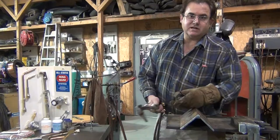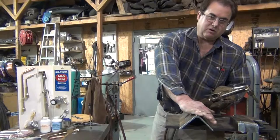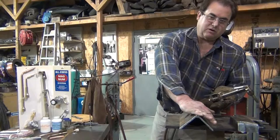You'll notice that we won't have to follow it down like a standard blue-flame setup. We're going to take advantage of this Magnum torch. I'm going to anchor myself and just point the torch at it. You'll notice how clean burning it is and how fast it is on the preheat. This is a cold piece of metal and we're going to start her up and show you what it can do.